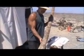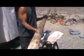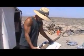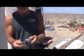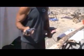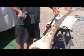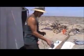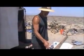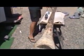So now I've got the line drawn, as you can see. Top and the bottom came out okay. So now what I'm going to do is I use a Dremel with this nice little bit here. I don't use a machete until afterwards because the machete a lot of times will go for a while down the right spot and then it'll veer off and your cut will be crooked. It doesn't always follow a precise cut. So what I do is I use this first and then I'll take the machete and cut down through the side, and I'll show you that later.